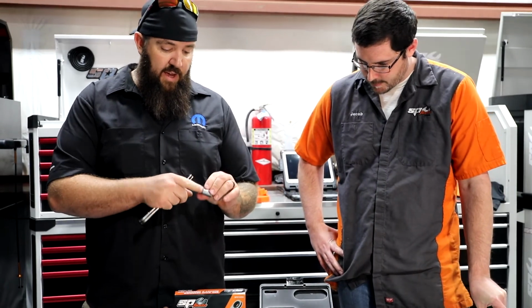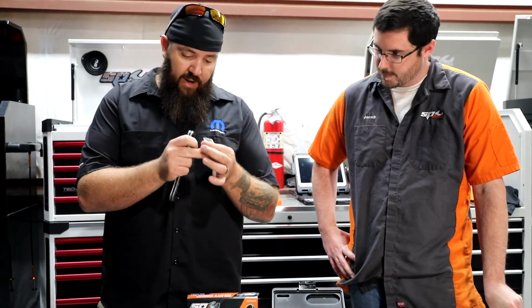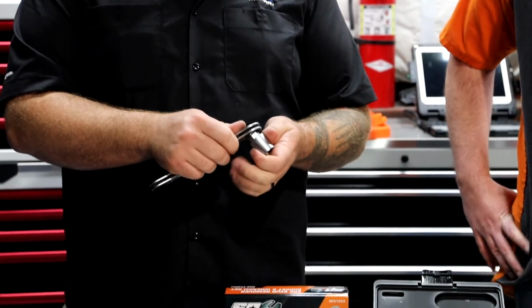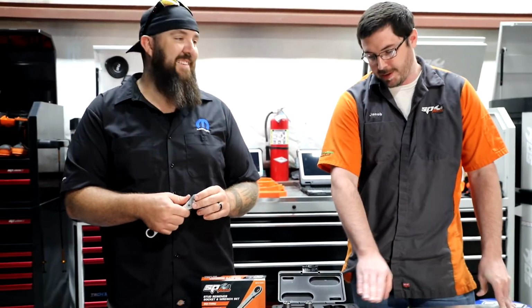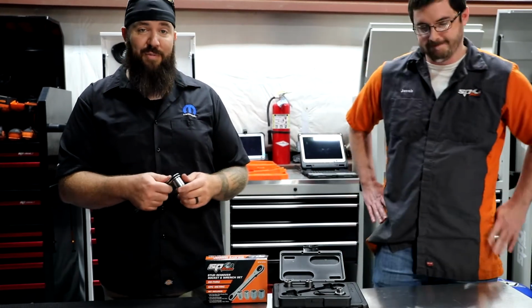It's got the locking bar style grips inside of them, and when I look in there, the lock rollers are actually knurled on the inside, so it looks like it's going to get some really good grip. Yeah, and it's worth noting that these are just for removal. You're most likely going to gall the threads pretty bad. Yeah, but you can use that other set for insertion, but this is only for removal. Yeah, this is for getting out the rusty ones from the Rust Belt.